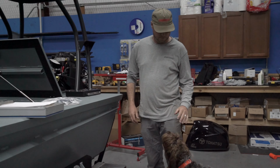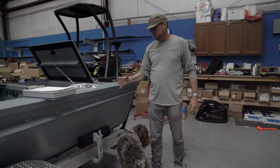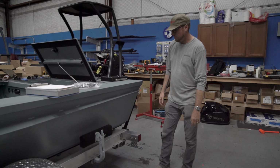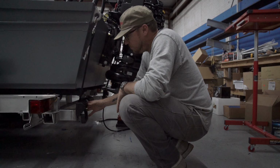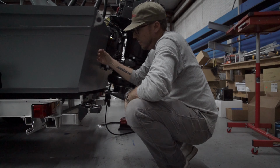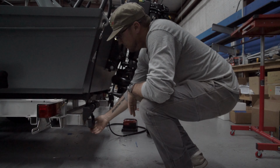This is a river skiff edition, so with the oars, we actually have our boards down low. We don't have the PVC uprights because the oars would catch the PVC uprights, maybe in a current situation where you have to get on the trailer real fast. So we drop the lower board on these trailers. All of our trailers come with the boat buckle style winches on the transom end of the trailer, so they never leave the trailer. It's easy, it's convenient at the boat ramp.